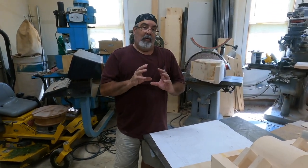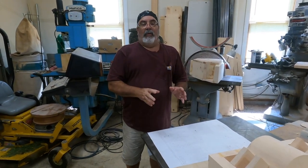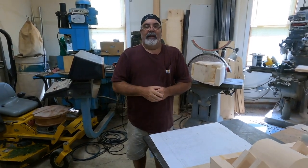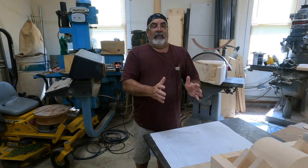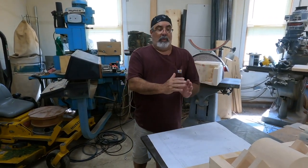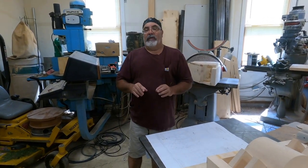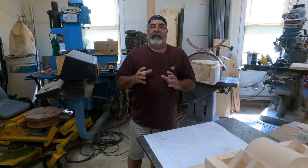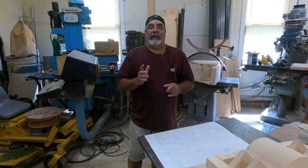You can hopefully see the 2D going into 3D. Don't worry — you're not going to pick this up the first time watching the video. It's going to take time after time after time. It took me five years to learn this trade, and I'm still learning today. Hopefully that answered a little bit of the questions: we have a casting or a drawing, we lay it out on a board with our shrink scale and all our machining allowance, and that way we know where the pattern is supposed to be. Instead of me sitting in front of a computer typing for an hour, we're going to try to make a few shorts and answer some of the questions from the comment section. Everybody have a good one out there and stay safe.